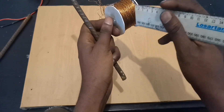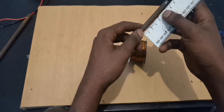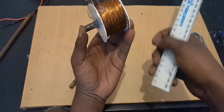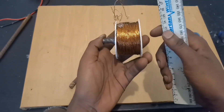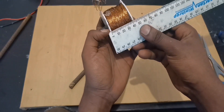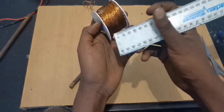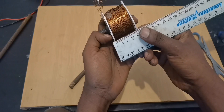We can use them as the holder. Because I cannot use the whole seven centimeters to wrap the wire — from here to here is seven centimeters, end to end. But I cannot wrap the wire in the whole space. So I measured 40 millimeters from one holder to another holder. The space for the wire is 40 millimeters, not 40 centimeters.